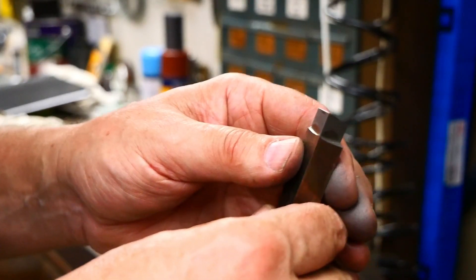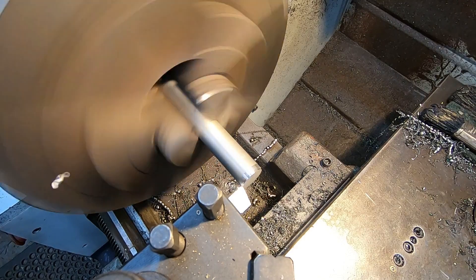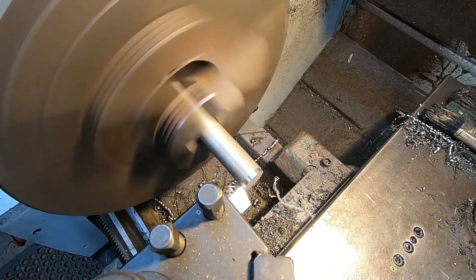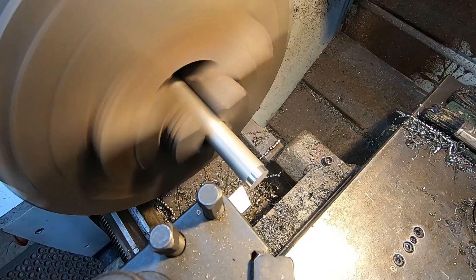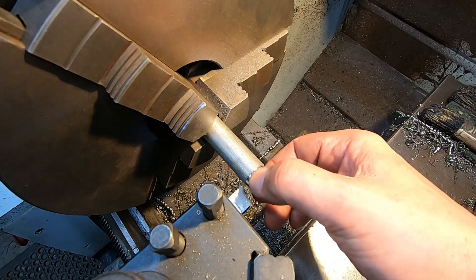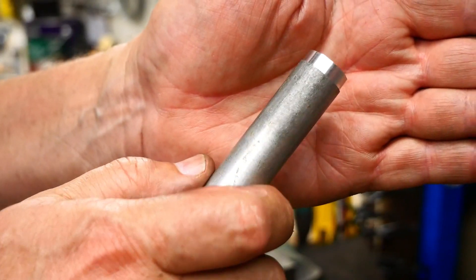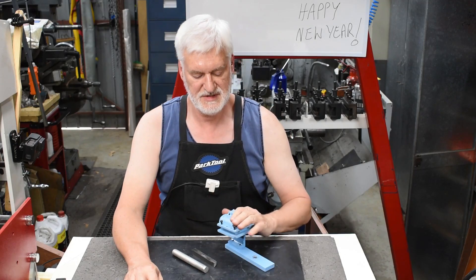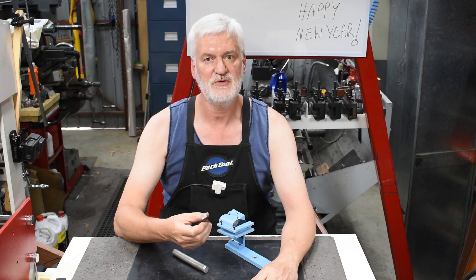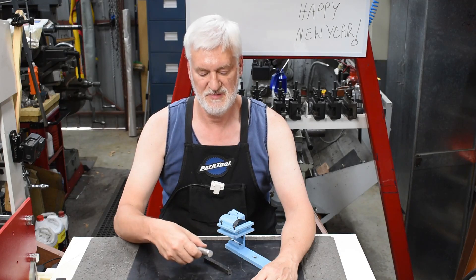So that's the final version. For the test cut I'm going 0.5mm depth of cut in a 20mm aluminium bar, and that's really what I sharpened this tool for — for cutting aluminium. That's pretty good. So that's a pretty good surface finish, I'm happy with that. This has been tested now, found to do what I want it to do. Found it quite easy to use to create this sharpened tool and got a good result in my aluminium test bar.